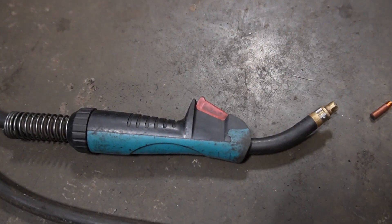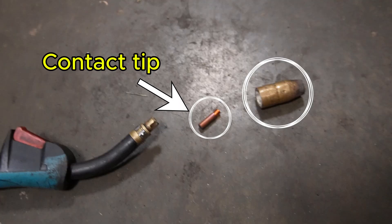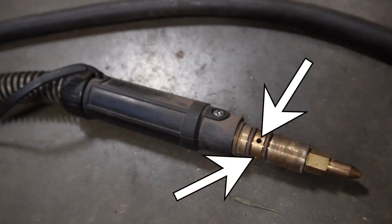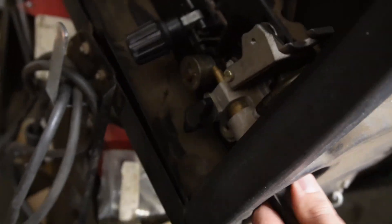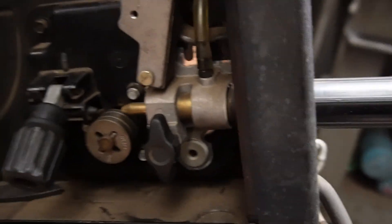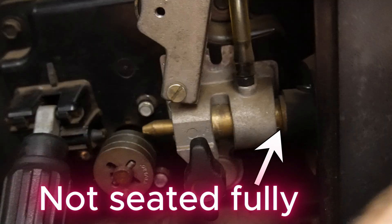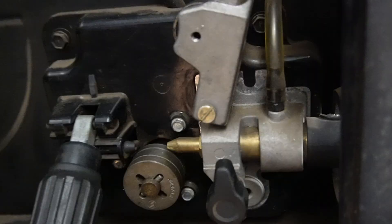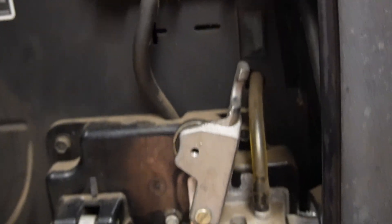When it comes to parts of the gun and consumables you should be concerned about, it's really only two that wear out the most: the contact tip and the nozzle. The part that goes into the welder has little holes where your gas goes into the liner, through your lead, and up to your gun. Make sure that part of the lead is fully inserted into the welder so gas can flow through those holes — not being fully seated is a really frustrating problem.